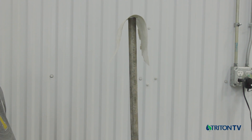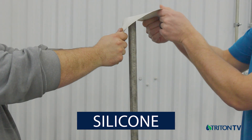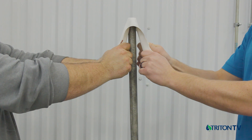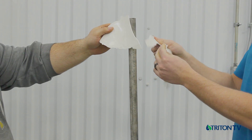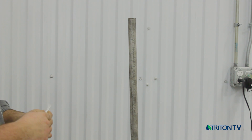Now we have silicone, approximately 60 mils or 1.5 millimeters, cured for two weeks. The strength is higher than acrylic, requiring more force to stretch it over the pipe, but once the silicone breaks it results in a very quick tear through the entire sheet. While tensile strength is higher than acrylic, the actual tear resistance is poor.